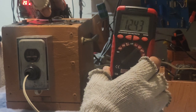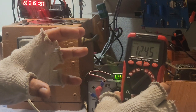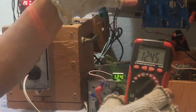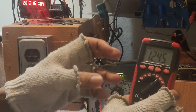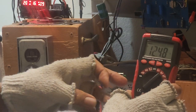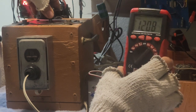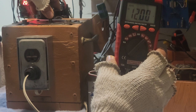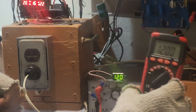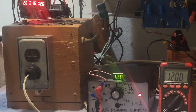So this one is actually very safe in which if we needed 6 volts, of course, the input voltage that you should be using will be 6 volts. Because if you use 9 volts, the circuit in which this voltage will be applied will get burned. So if you needed 12 volts, you just rotate this one till it reaches the value 12 volts. And you could use this one now to your amplifier. That's the other method on how to vary the voltage by using a variable transformer.